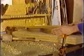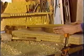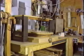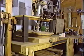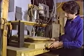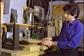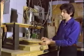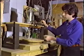After having glued the back on, we'll take it and show you what it looks like when we put the assembly in the pneumatic press, which is basically a press that will glue this back onto the sides. I've placed the glued up sides and back combination in this pneumatic press, which basically forces the back down over the sides. And I've let it set in here with glue for about an hour now, and I can release this lever which will lift the press.